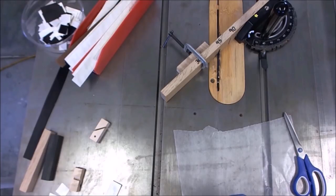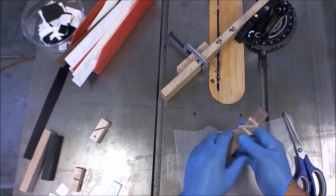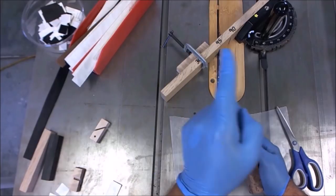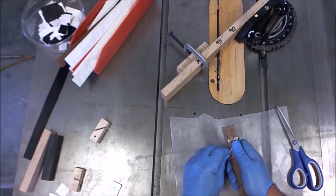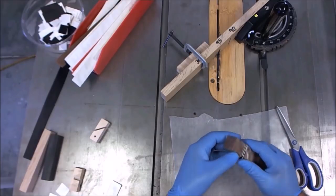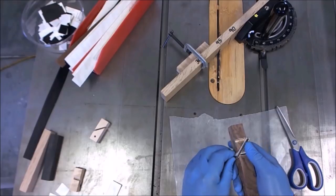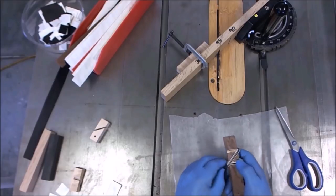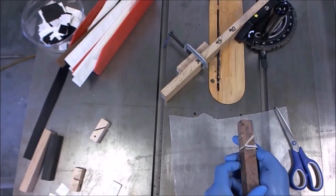Also, the key that I didn't mention earlier was make sure that your blade is a 90 degree angle on the bottom. You don't want a blade that's not a 90 degree, otherwise you're going to have a little triangle thing going on, and you're going to have to get in there with a 1/8 inch chisel and flatten out the bottom. It may not seem like much, but when you turn it, every little piece that you need in the middle is going to get you your center.